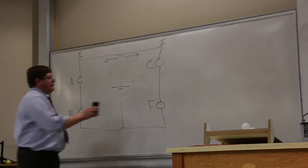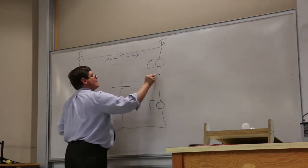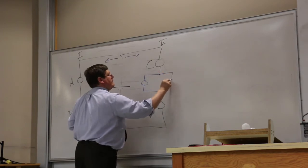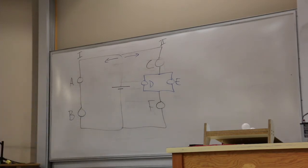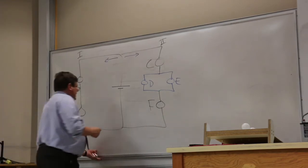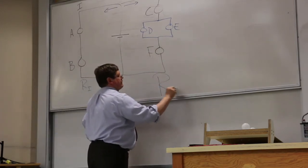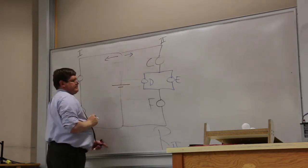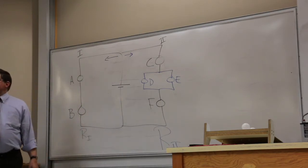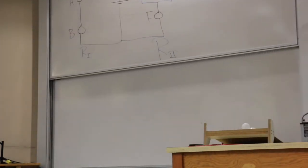If I have to pick up the eraser and break an existing line to shove the new stuff in, I just cluttered an existing path. I just added those in series. I just increased the resistance. So now, if this is the resistance of one, the resistance of two is bigger. And that means it doesn't split 50-50 here, but some other way. Okay? That makes sense?